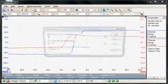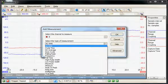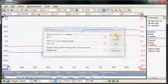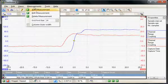So I'm going to add measurement, so channel B, and do a rise time measurement, and I'll leave it on the whole trace. So the probe now is measuring the rise time as 2.1 nanoseconds, and again this is doing a 20 to 80% measurement. So just finally we'll just do a third measurement using a 10 to 90%.